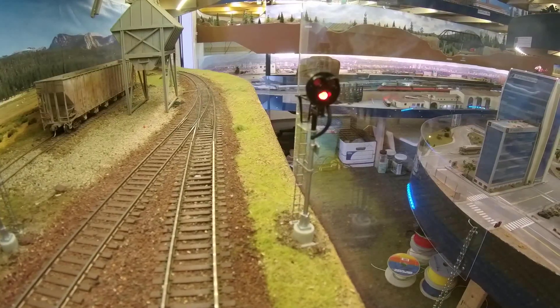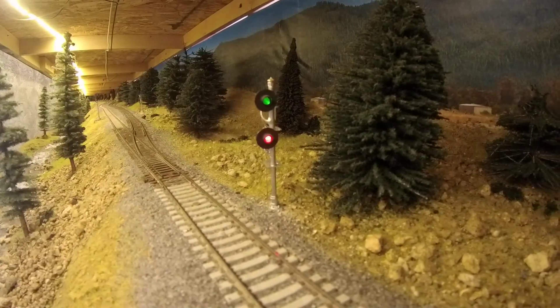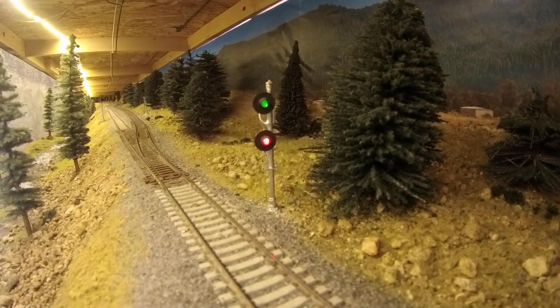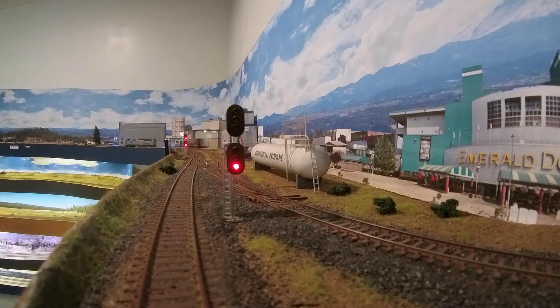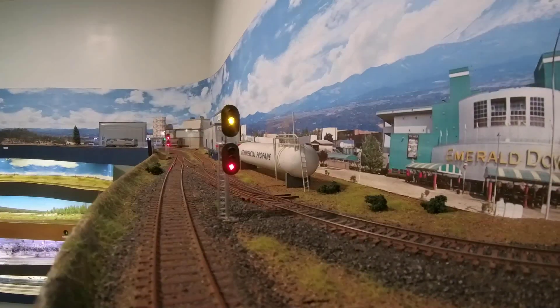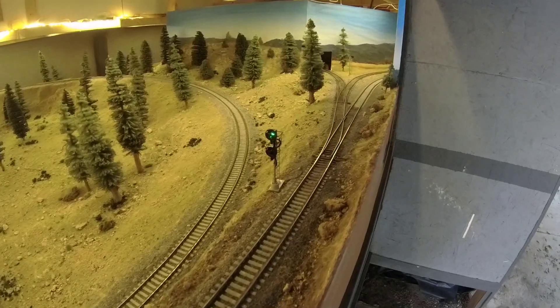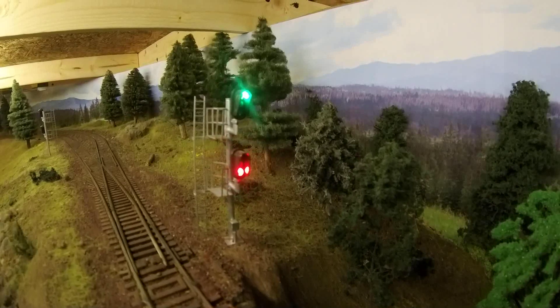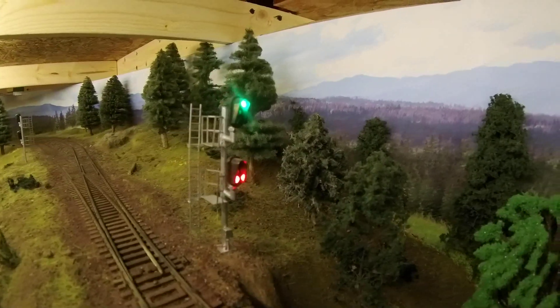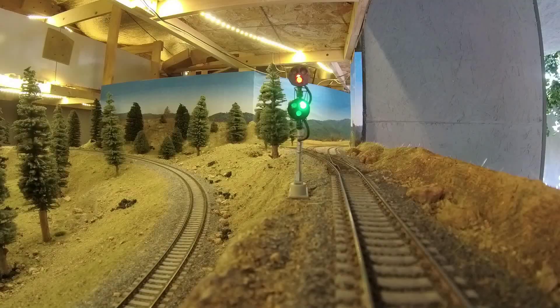There's the Type-G, the modern hooded, and the Southern Pacific Target style, which has three LEDs — red, yellow, and green — on the same lens. We won't go into flashing aspects in this video; however, most of the systems I'm aware of can accommodate this if desired. You also have two signal head variants of the three types mentioned for diverging control points. The lower signal is for the siding and the top signal is for the main. Hence, red over green is a diverging clear, as the tracks diverge and go into the siding.